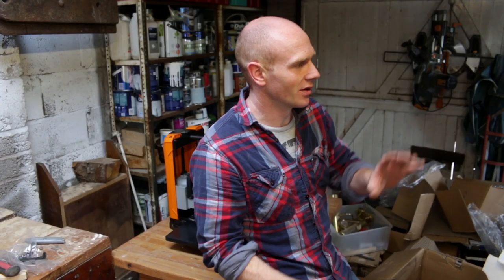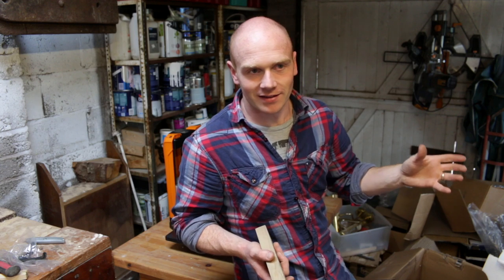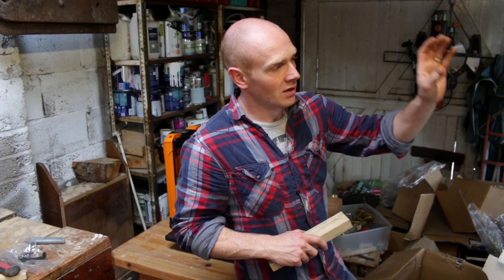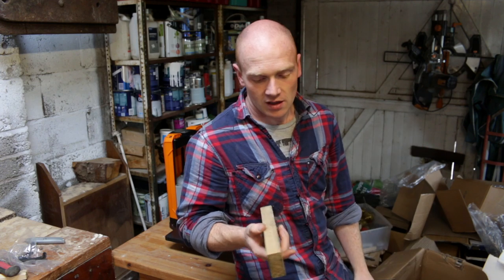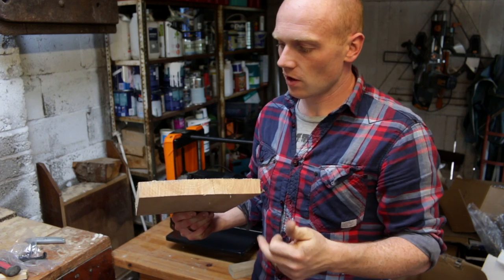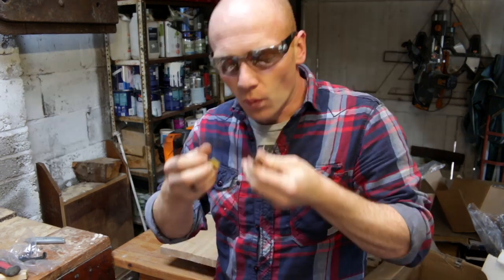I've been out to the burn pile for all our scrap wood and there are some really nice hardwoods which came from the pallet when we ordered the limestone. Unfortunately I don't trust that to be grit free — it might be worth planing it through in the future with a designated set of knives for that sort of old outdoor wood. The last thing I want to do is ruin these blades with grit. So I've brought in a little bit of poplar to test, and also another section here — fairly rough sawn but pretty even for thickness. There's a little bit of a cup to this board, but we can make jigs to flatten out boards using this without a jointer or a planer.